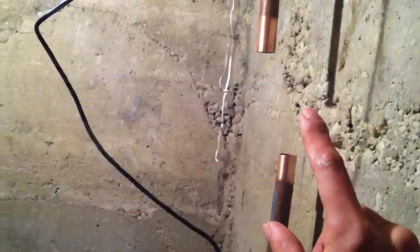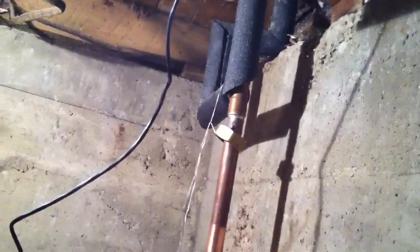I'm in the basement and this is the water main. I made my cut already on the cold water line, and you want to do this before you get to the fixtures. If you do it after you get the fixtures, the pressure will be high once you get to the fixtures and you'll have defeated your purpose of the installation.